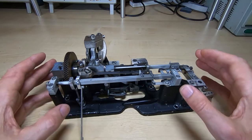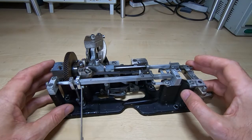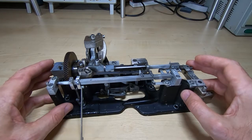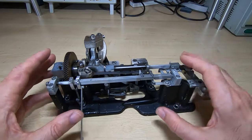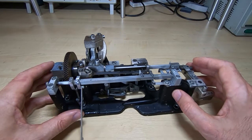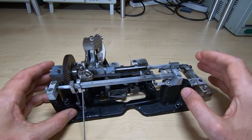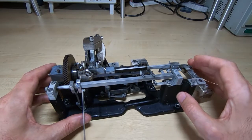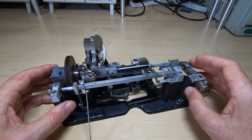It also decodes the incoming stream of pulses that are fed to the solenoid to create a decoded version of the binary value that is sent to the teleprinter. In a minute I'll show how this fits into the parts we've already looked at, but I'll just quickly explain how this unit works. There are certain aspects I'll come back to in future videos because it performs quite a few different tasks.